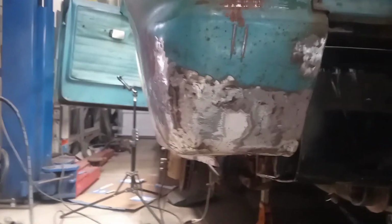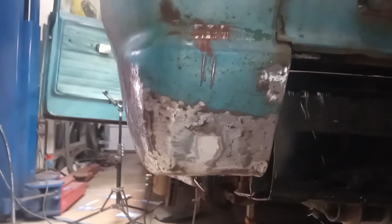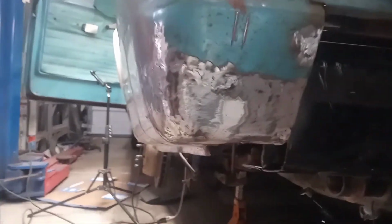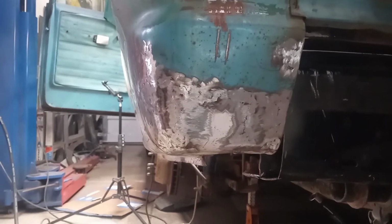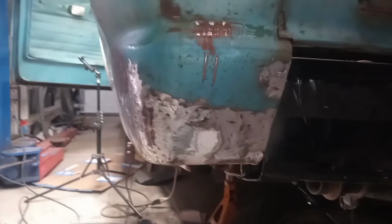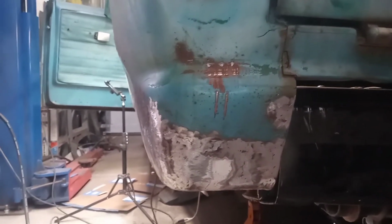Beyond the fact that I am going to go over every single seam with some fiberglass Bondo instead of just the talcum powder style stuff. Since that, I'm told, is actually waterproof, so it will seal the welds in case they're imperfect. It'll also give a little bit of extra strength to them and some smoothness. So I'll probably go over all of my seams with that stuff before I paint everything, though when I paint it, I'm going to be shooting basically for a kind of patina match type thing.